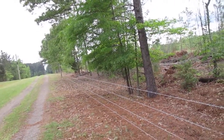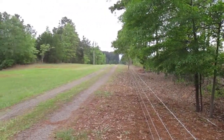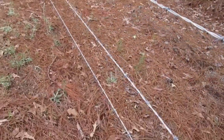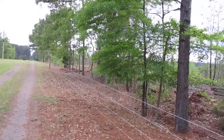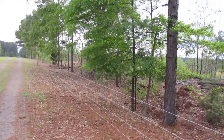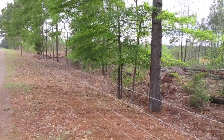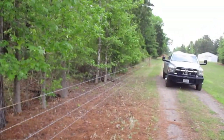It's pretty much personal preference. Like I said on a previous video, that's pretty snug — not too bad there, not too bad there. That's a hundred and something feet between my line posts. The t-posts, like I said before, all they do is maintain the wire gap and anchor the wire between your line posts, your pulls, or your double or triple posts in your corners. And I like the tension I got.